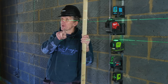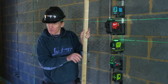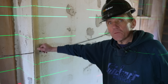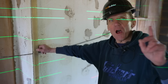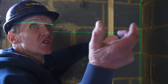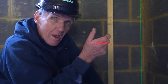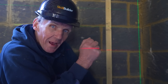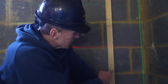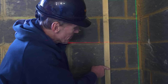We've got a 10-by-4-meter room, which is a fair test. What this tells us immediately is that over a distance of four meters all of these lasers are within the lines. We had to turn a few of them around to get them to show on the side wall, but once we did, the accuracy was not lost — so that's really interesting to know. If you can be bothered to do that, you don't lose any accuracy, though it is a question of convenience.